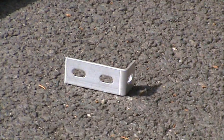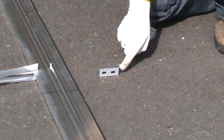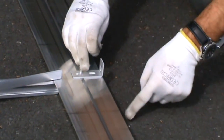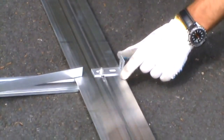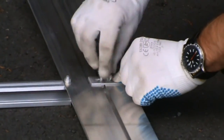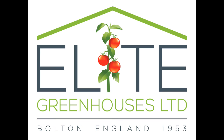On the assumption that this greenhouse is going onto hard standing, in the main bag of fittings you will find a number of unequal angle brackets — the number depends on the size of the greenhouse. Line up the top slot with the previously inserted bolt, then move into position so that the bottom of the angle bracket is in line with the built-in base. Tighten with the nut. Do the same for the other angle brackets; it doesn't matter where they go along the base. As a general rule, put one bolt at the bottom of every glazing bar. You do not need to attach the top of the side angle to the gutter bar at this stage. One side is now complete.